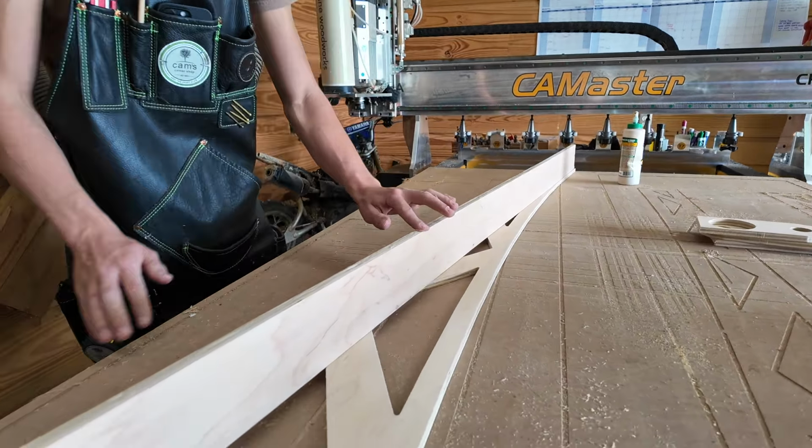It's a dream. This is the part of the assembly process where it's easy to make a mistake and put the brackets in the wrong place or the wrong direction. You can see I'm taking my time on this and making sure I have accounted for the right pieces. I haven't noted it, but we're using 1/2 inch plywood for this whole project, and I used it for my last one and it's plenty strong. But for the bottom bracket, we doubled it up so we'll get a full inch of width for strength.